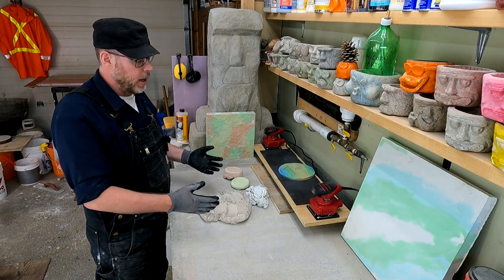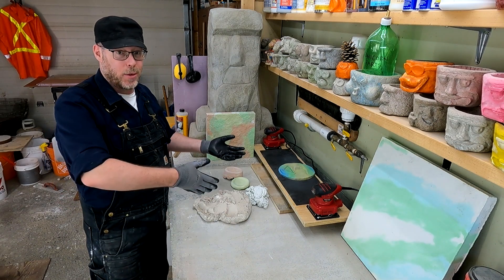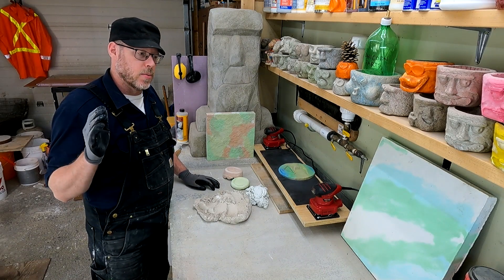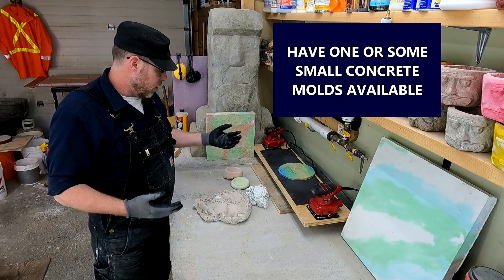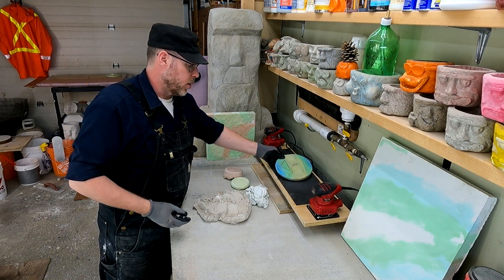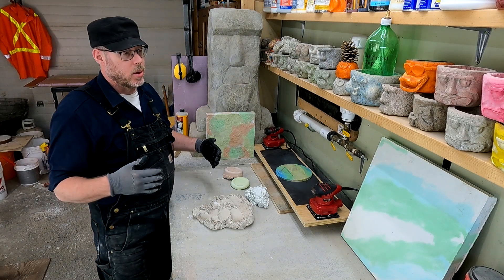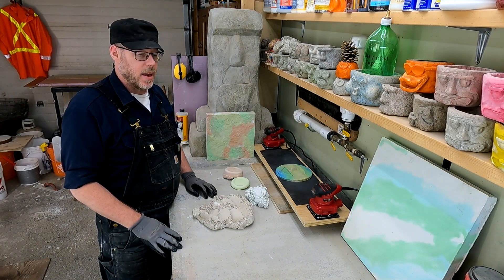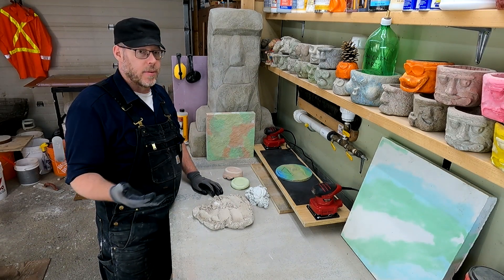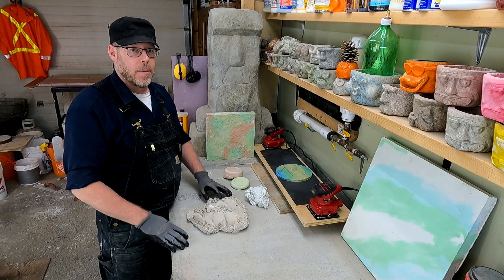You never want to come up 10% short on whatever you're making, so I always teach to make a little bit extra. A really good solution is to get some small molds. I've got this cast piece of concrete that I've painted and it doesn't use very much material at all — a chunk this big at the bottom of the bucket would be enough for two, maybe even three of those. Keep those molds clean, oiled, and ready to go so whatever's left over doesn't just become a lump of concrete you have to pay to get rid of.